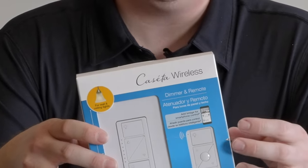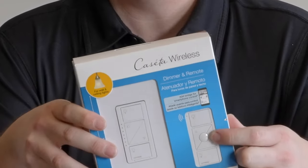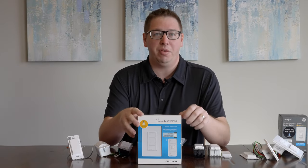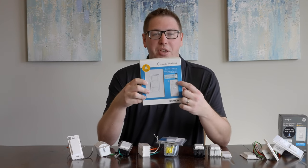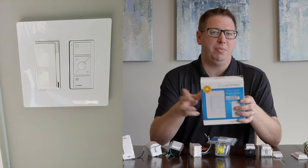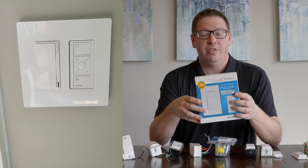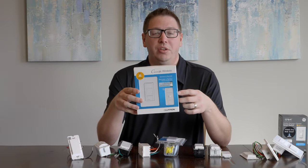A good example is Lutron. What you'll do is go to where the second position is, take those wires, and actually tie them together so it passes the power right back to the original switch. In its place, you're going to put this Pico remote. The Pico is programmed wirelessly and has a battery that lasts about 10 years, and that's going to connect to the switch directly. The nice thing is you can actually program these Picos to control a number of different switches and tie other switches together.